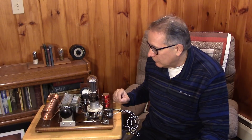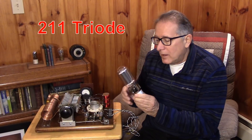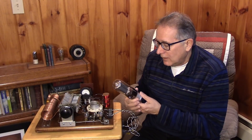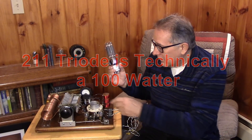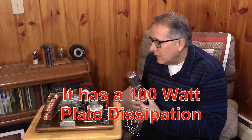This transmitter can put out some pretty serious power. The 211 triode has gotten a lot of popularity again in the audiophile world for single-ended Class A amplifiers and in triode push-pull amplifiers up to about the 50-watt region. In fact, these tubes were called '50-watters' back in the 20s. Stand by for an interesting video on the 1929 QSO party using 1929-type circuits but with modern parts in order to build the circuits today.